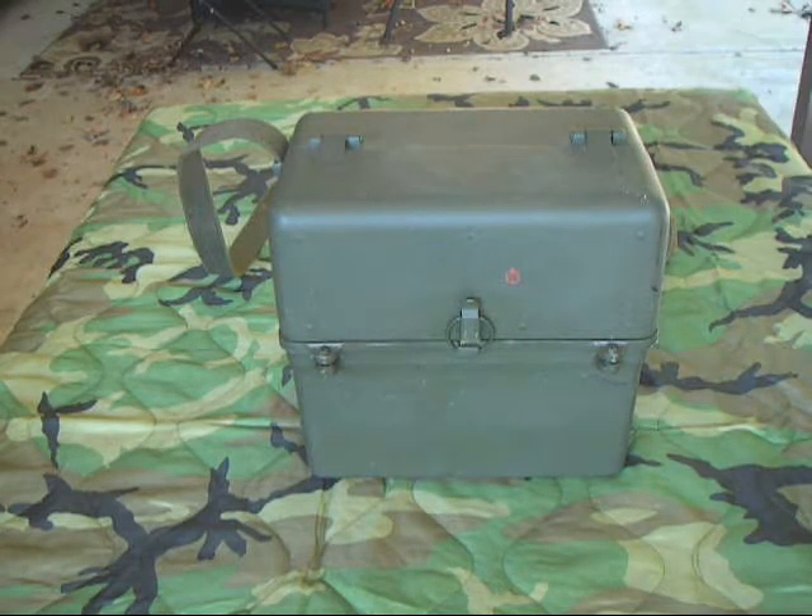If you had a length that was, say, 10 miles long, and that's as far as you could go, you would put a repeater in midway at 5 miles, and you'd be able to use your normal field phones. The problem with this in a combat situation in the field is you're going to be able to put these telephone repeater boxes out, but they were battery-powered. They had to have guys change the batteries, and they required adjusting on occasion, so you were constantly having a team of signals and wire guys going around adjusting these.